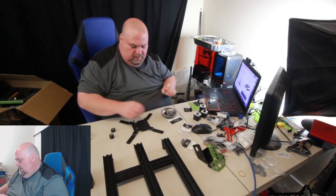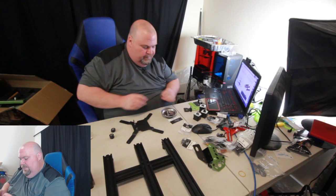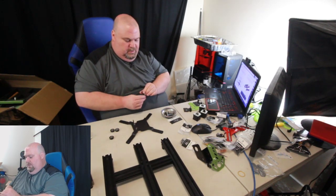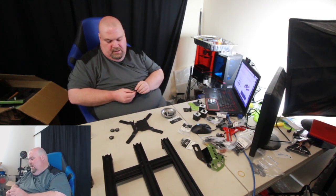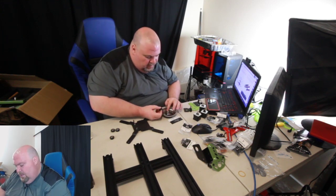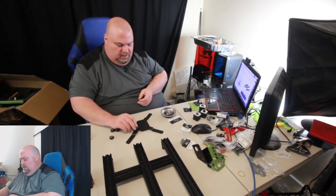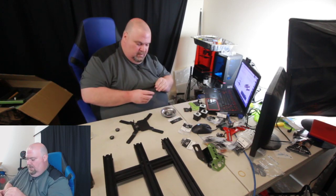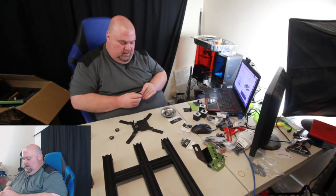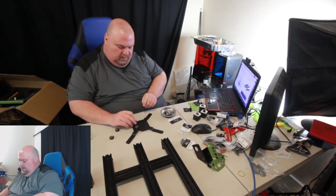Okay. So that, yeah, I had never heard of an eccentric nut until I got into 3D printing. And they're different. So take one of these. We put one of these on. Oh, so these are little, what's it called? The washer that's in the center of these was a little off. It's kind of an issue you had with the original Tarantulas. Then it says a precision, which I'm guessing is just the washer. And then you go through the eccentric and then go through that. So I'm going to build both of these. So you just have to get something narrow there to push that washer back. And put this washer on. And then this pushes through. There we go.